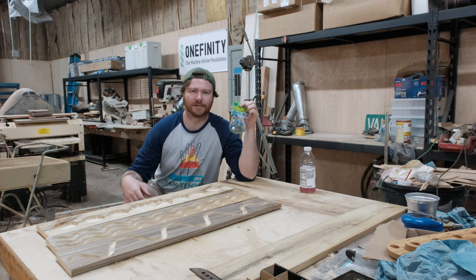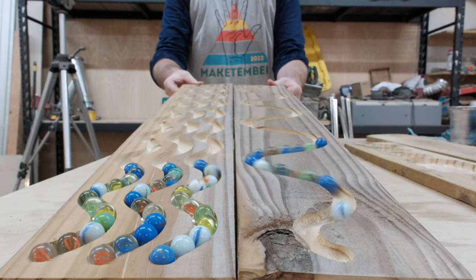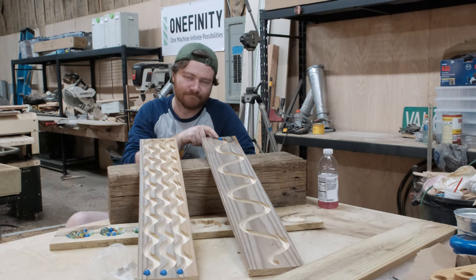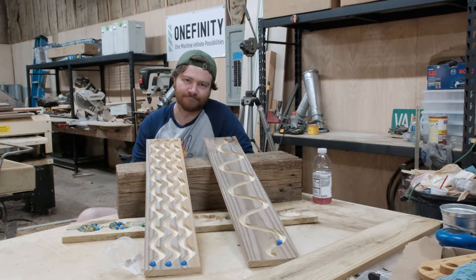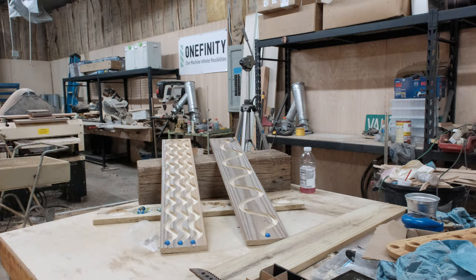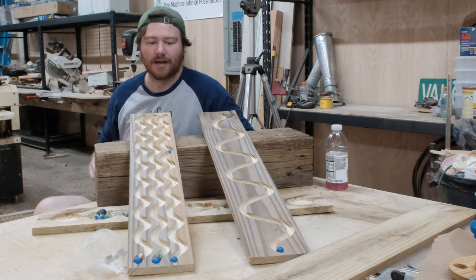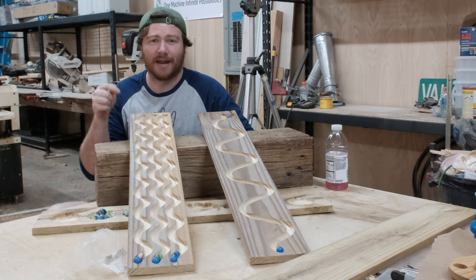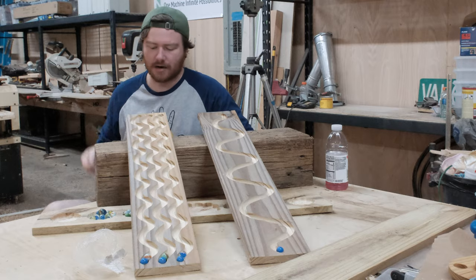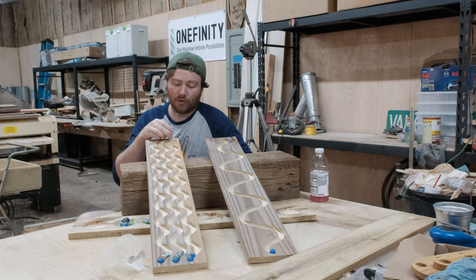$5.82 I just spent so that I could show you this. Was it worth it? Marbles everywhere. I made this file so that it can be used with any old fence board. These are three-quarter inches thick and I used my bowl bit to go down half an inch. I probably should have done about a quarter inch, but half an inch makes sure they're nice and seated in there. It took a little under 15 minutes to cut out all of this — that's with the bowl bit as well as the V-bit.